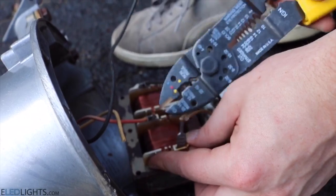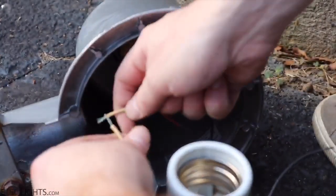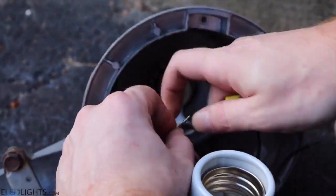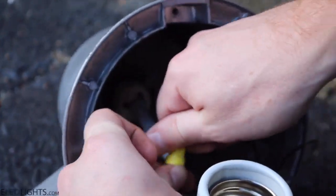This way it's in no play whatsoever. Now that it's being bypassed, we're going to keep the switch active. Here I have started by connecting the white wires first, and then I move on to connect the red wire coming from the photo sensor receptacle to the black wire going to the socket.